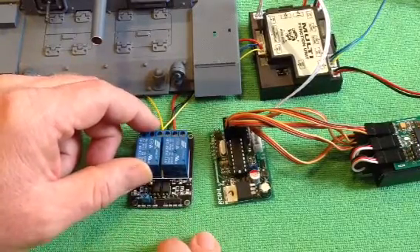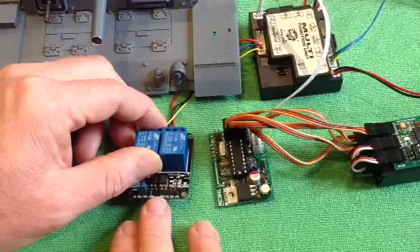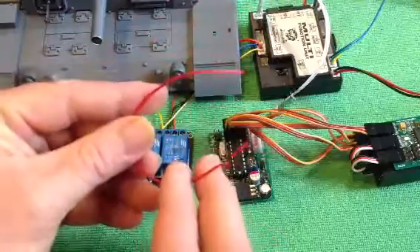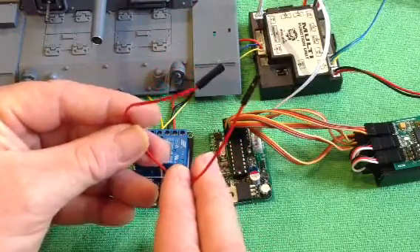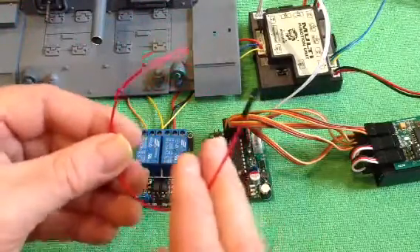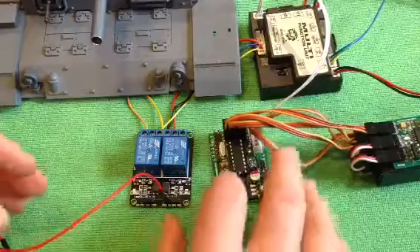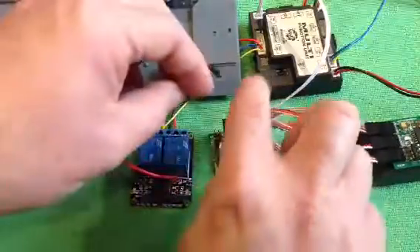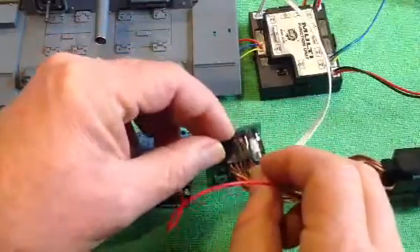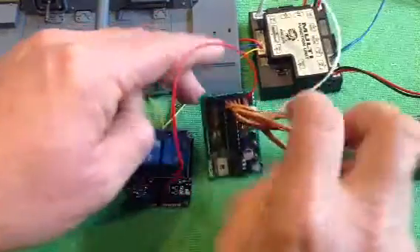Let's connect it all up. We're going to look for our ground supply and our voltage supply first. The ground pin is the one closest to the middle on this particular board. We can use these DuPont cable connectors — jumpers — to wire it up. So we'll connect up our ground pin there. The best place to take ground from the RC5HL is actually from the programming cabling port — that's this port right here, and this end pin is ground. So we connect that up and we now have our ground connected.